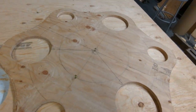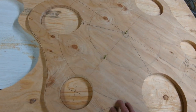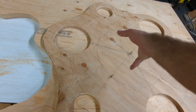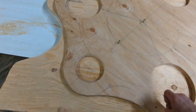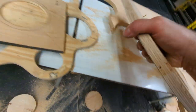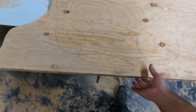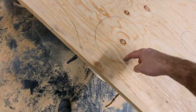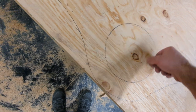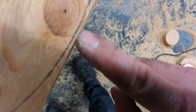I put an X to remember the axis orientation. Since I'm making these by hand they won't be perfectly identical at 60-degree rotations, so the mark tells me how to clock the pattern when I return. Now with the piece laid out in pencil, I'll drill into each of the three larger holes with a spade bit just enough to get a jigsaw blade in there, jigsaw them out staying just inside the line, and jigsaw out the whole exterior staying just outside the line.